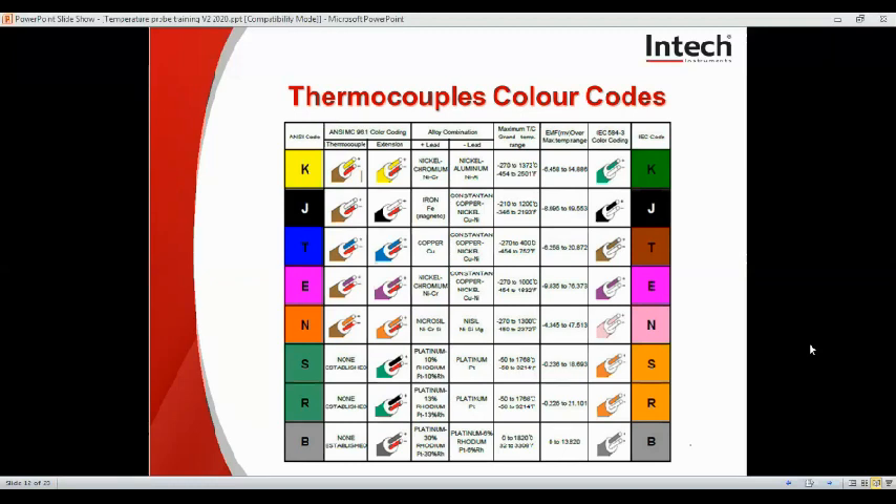Type K can do up to 1372 degrees, but typically it's used up to 1200 degrees, limited by the Nicrobell metal sheath. A J-type can do quite high, but typically it's not used over 400 degrees due to its fiberglass sheathing that may limit its range. T-type is typically used up to 200 degrees and comes in a Teflon coating that we stock. R-type is the highest temperature probe we can stock, rated to 1600 degrees, usually housed in a ceramic sheath. It's made with a very expensive, rare and sensitive metal and is not recommended to touch with bare hands, as it can affect its purity and contaminate it, affecting accuracy and longevity.